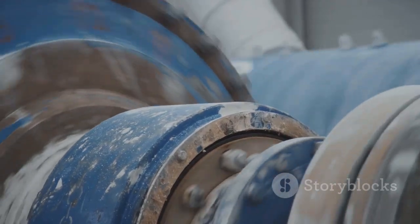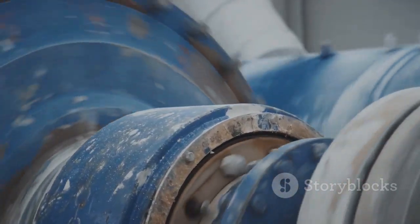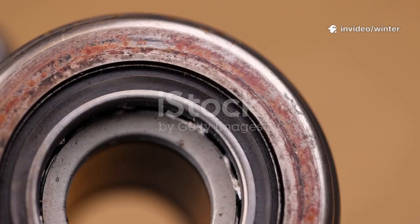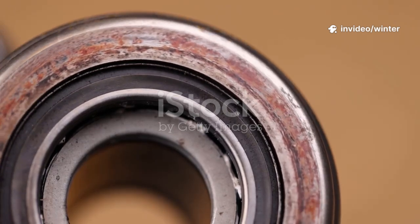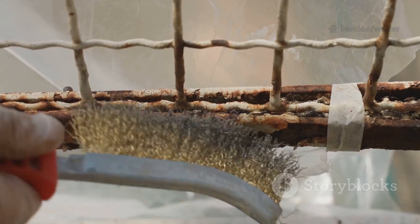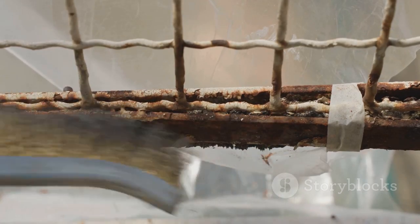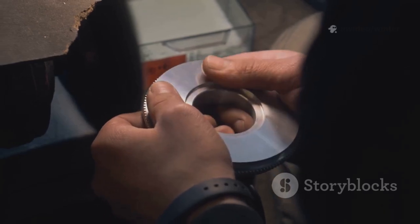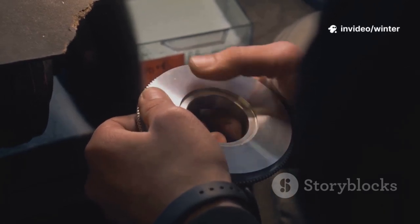Contamination, dirt, dust, or water is a relentless enemy of bearings. Even tiny particles cause dents, leading to surface fatigue and spalling. Water displaces lubricant, causes rust, and can halve bearing life with just a trace. Protect bearings with effective seals and clean handling of lubricants.